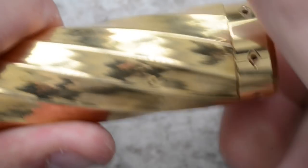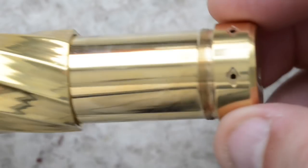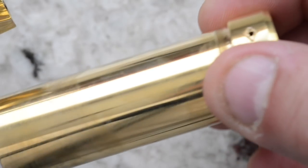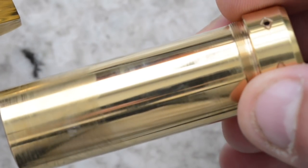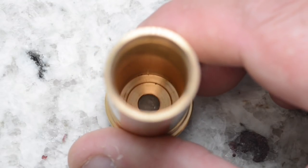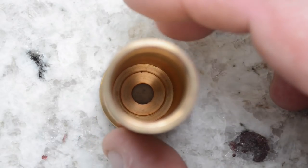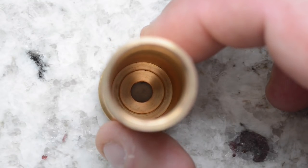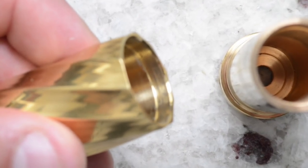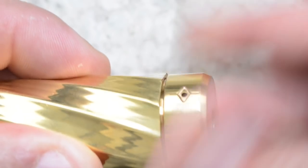The sleeve is actually threaded into the tube. If you back out the tubing you'll notice very fine threading at the very top portion — it's a very high gloss polished brass, very very shiny. Looking down into the center of the 510 connection, there is a slight ledge that dips down towards the 510 connection — they do that for battery safety so your battery doesn't arc when there's no RDA in there, preventing any shorts. When putting the sleeve back on, make sure the threaded portion of the sleeve is facing the top 510 area and thread it on that way first.